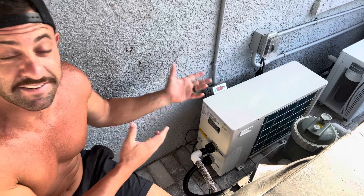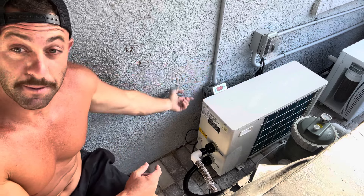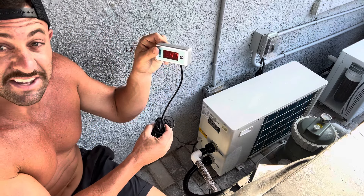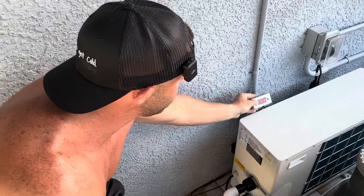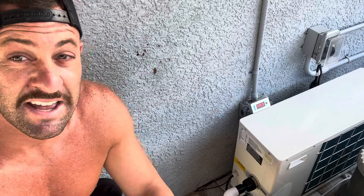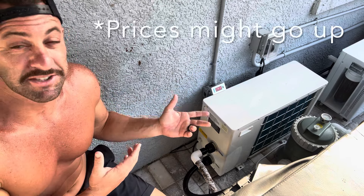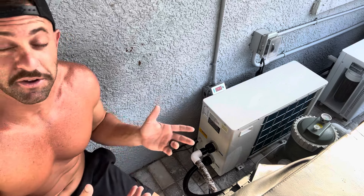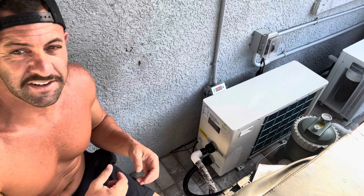What I really like is that the display is on the backside, but it comes with a 30-foot cord and a remote so I can adjust it from anywhere. This chiller also goes down to 37 degrees — two degrees colder than the Active Aqua. It pulls 11.8 amps running, but it's so efficient it's not running all the time. Right now the one-and-a-half horsepower is $1,235 on Amazon, which makes it less expensive than the Active Aqua.